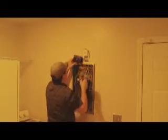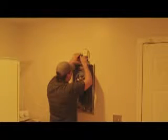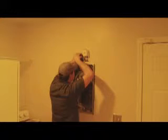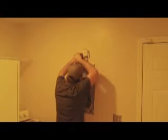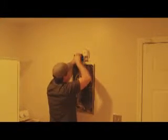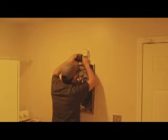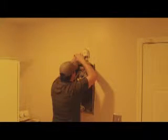Now, since this is my home, I just had the wire come directly out of the wall. Sometimes it's easier, especially if you're already dropping an outlet, to put in a low voltage retro ring, and usually a coax wall plate works well. This will give you enough space to pull your wires out through. Let's go ahead and connect that up.